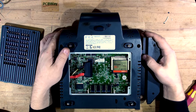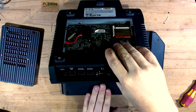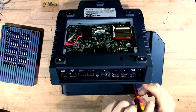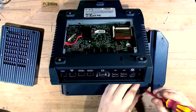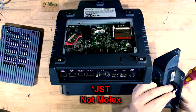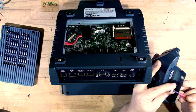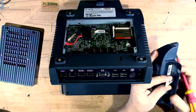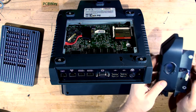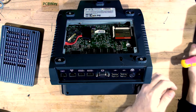Let's continue opening it up. Next we'll remove the fingerprint scanner and card reader, which is a standard addition for any POS - it comes as a module. It simply screws in with a plug - it's an 8-pin Molex with USB and COM combined in one. It feels a bit loose so that needs to be cleaned. That fingerprint scanner is dirty and sticky.